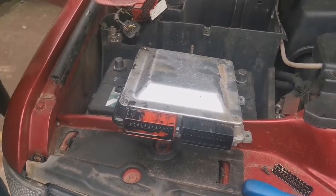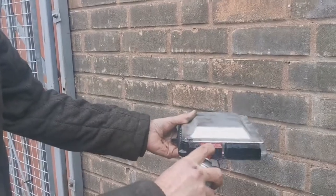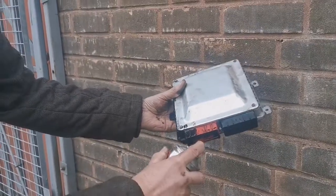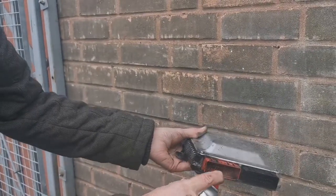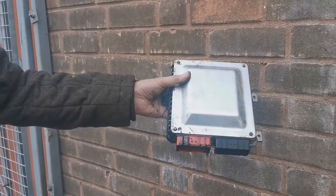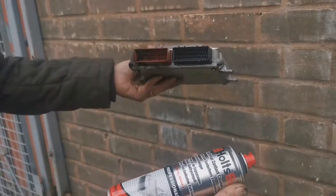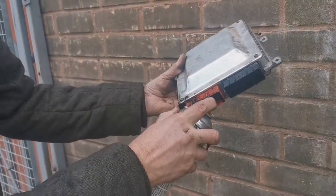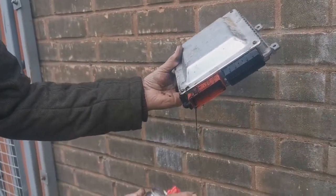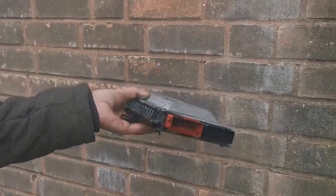Please like and subscribe. We've got some electrical cleaner here and as you can see it's pouring out. It's best to use electrical contact cleaner if you can — that's really the best stuff to spray in there, because if you spray brake cleaner or that sort of stuff in there, you never know what it's going to do to the circuit boards if it gets through.